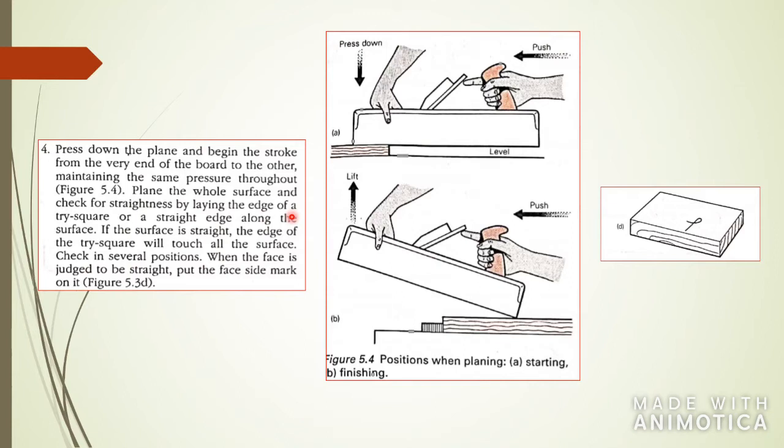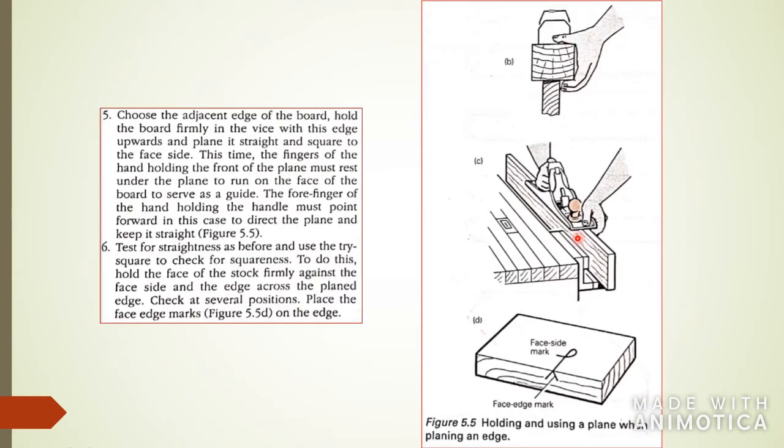Here you see another way you can plane vertically as well — it doesn't have to be a flat piece of board. You can do the edge of a board, and a clamp is used to secure it. You always want to mark the side that you are planing, because you can get confused and plane the wrong side. Marking is very important — if you don't mark, you'll run into trouble. Make sure you mark the face side and ensure you're planing the right side.